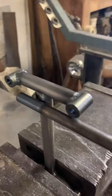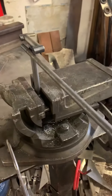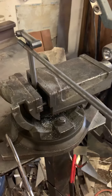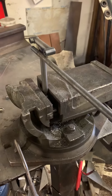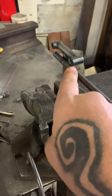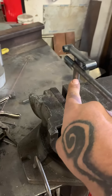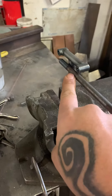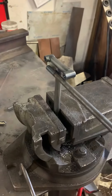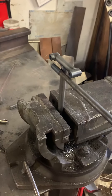I have the three-eighths inch round stock tacked up under there and around the back. I'm going to start heating it up — you don't want to distort the round stock. I'm not sure if it's going to work, but I think it will. You're trying to heat up just a certain area as it wraps around the half-inch cold rolled. If you go too crazy, it melts and distorts and starts deflecting, and then it doesn't look consistent — it just looks like a tack job.